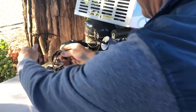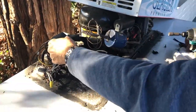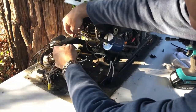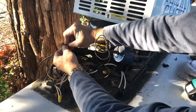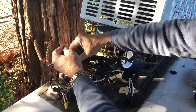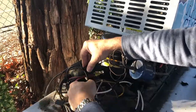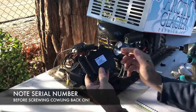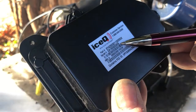Now, take the cable from the back of the freezer, coil up the excess wire, place a zip tie around it and carefully zip tie it to a suction line on the compressor, being sure not to attach it to any high temperature or moving parts. Next, take the controller and write down the serial number. This is crucial so you do not screw the cowling back on without noting this number.